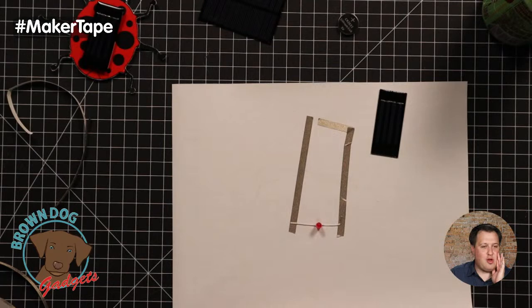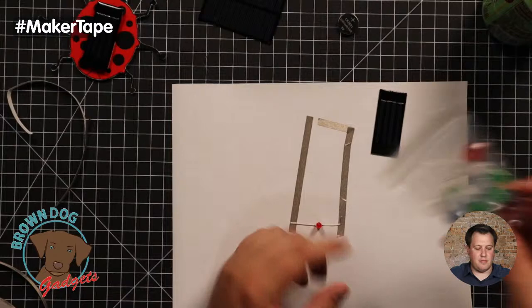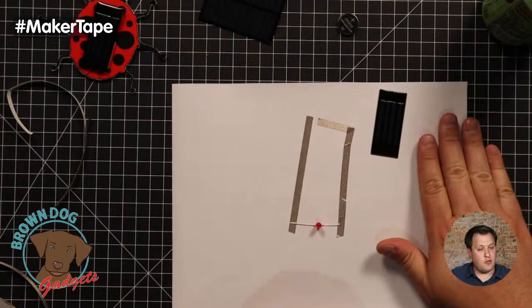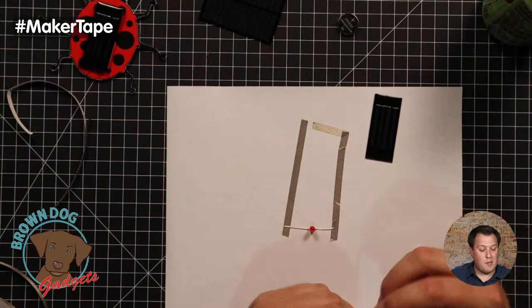Yeah. Or if you're using one of our big jumbo LEDs, like the ones we have in our kits, these have built-in resistors on them. But in most small situations with LEDs and like a 3-volt, especially coin cell power supply, you're fine. When you're using AA and AAA, then you really want to watch out because they have a lot more kick behind them, a lot more chemical energy.